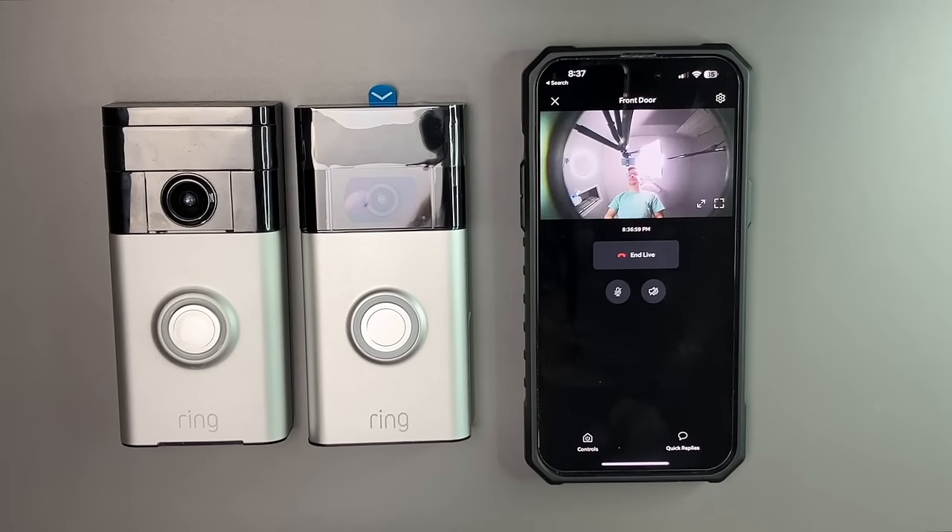To get our indoor chime to work, go into device settings, then in-home chime settings, and then automatic chime detection. It says 'easily detect and set up your doorbell chime.' It will check your doorbell system and ask: 'Is your doorbell wired to an in-home doorbell chime?' Hit yes. Now it says 'ring it' — push the button. Just ring normally.